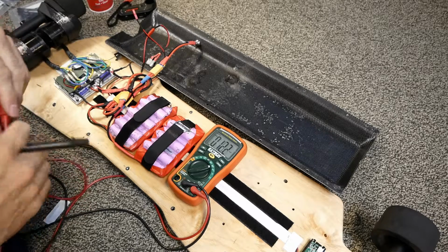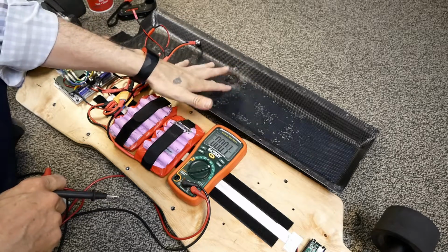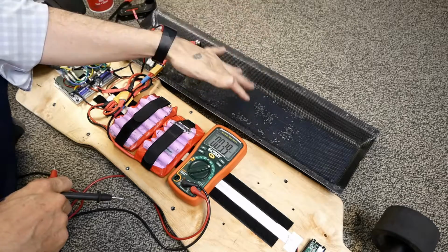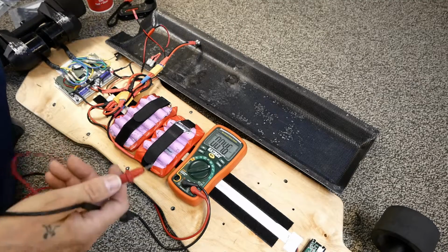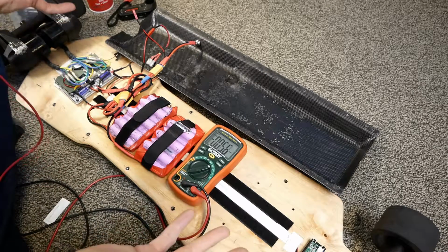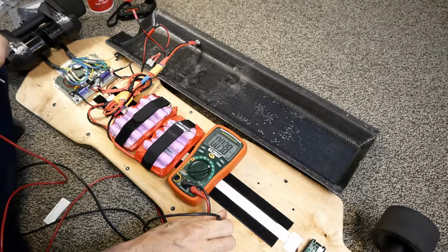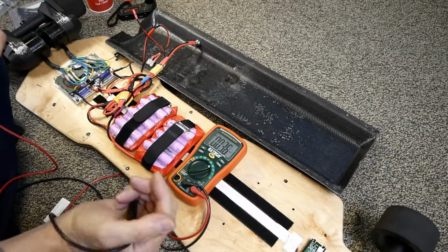Well, the reason is, and I don't remember if years ago I did another video on this, this is carbon fiber. This is legit carbon fiber, no coating. When I'm making these boxes, I now include a fiberglass layer on the inside to make it non-conductive, because carbon fiber is carbon, it's conductive. So that's fine. I mean, case ground has been around forever, so that's probably even considered a good thing, right? But if you happen to have wood that is somehow electrically charged and the two touch by way of a fastener, well, then yeah, you're going to have a bit of an issue.